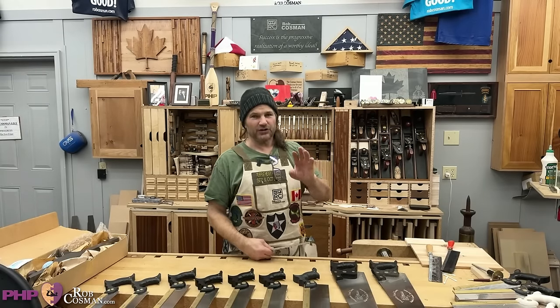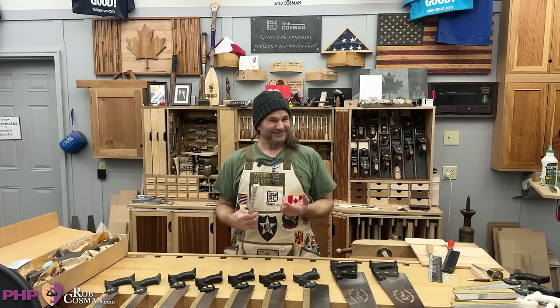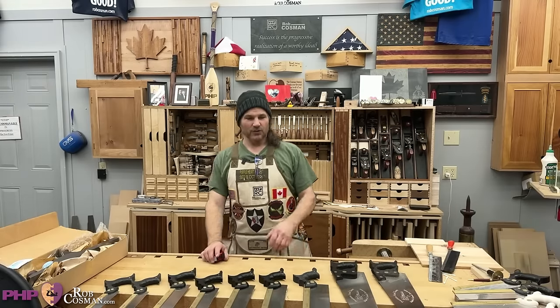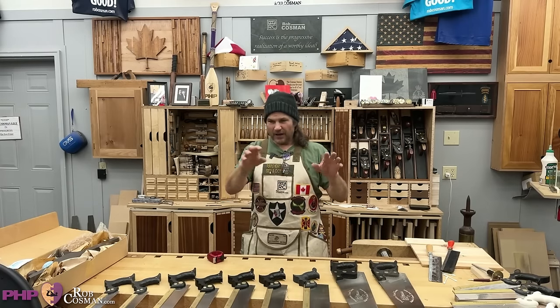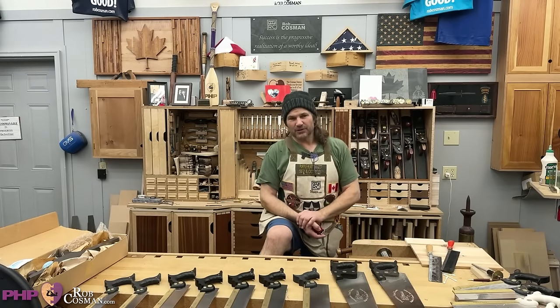So you have to determine where that piece that's going to be 1 3/8 finished has to come out of. If you're lucky, you can get it out of 6/4, but you may end up having to get it out of 8/4. Whatever, you've got to stick to that dimension. So you always got to round up, figure out how many board feet are in it, add in all the pieces, and then do your multiplying by 1.4 to figure out how much you're going to need.